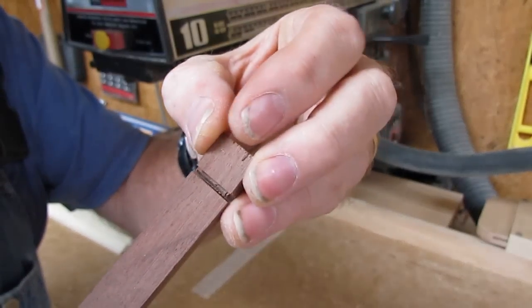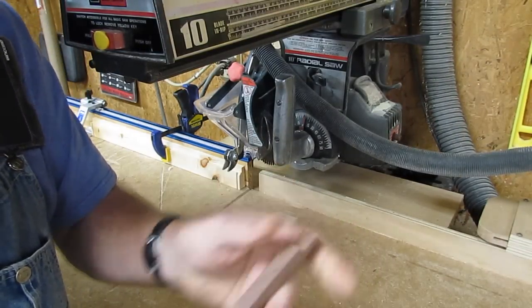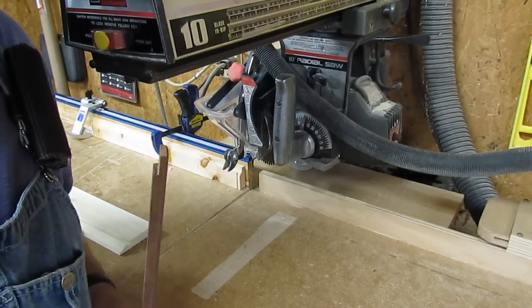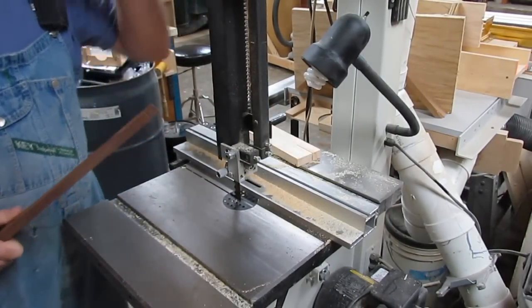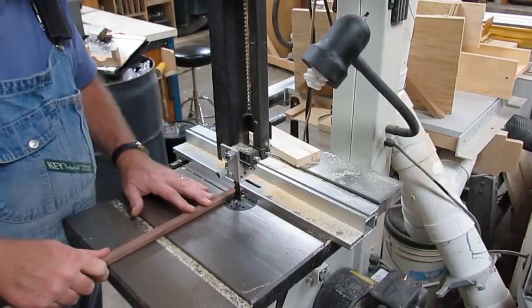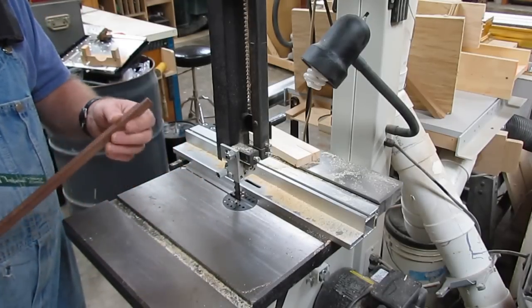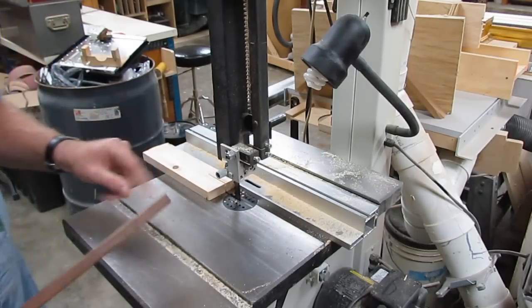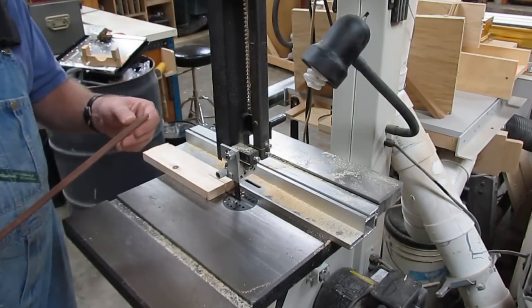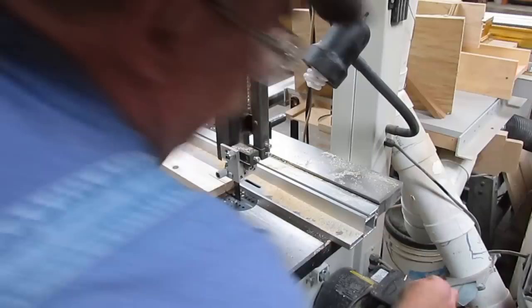That just leaves a little splinter - just take your finger and pull it out. I got that saw set perfectly the right height that time. A lot of times it's hard to get it that close. Now we're going to move over to the other bandsaw and cut this thing to the proper length. I probably have a little too coarse of a blade - I've been doing some resawing - but I use a backer on it to hold it straight, and it saws it smooth enough. We'll sand it after it's cut.